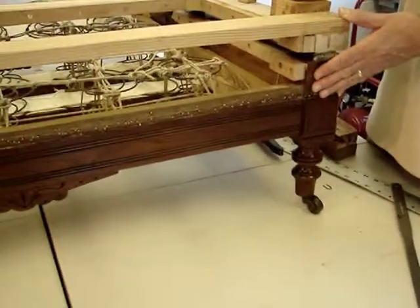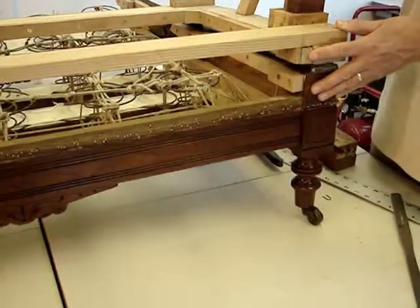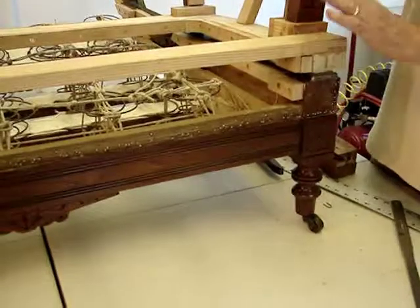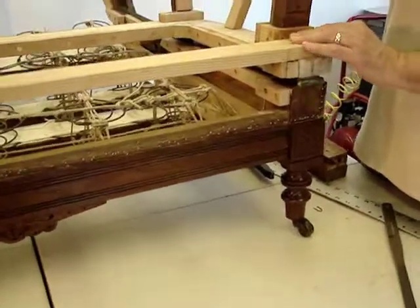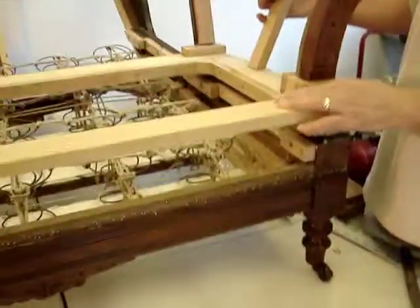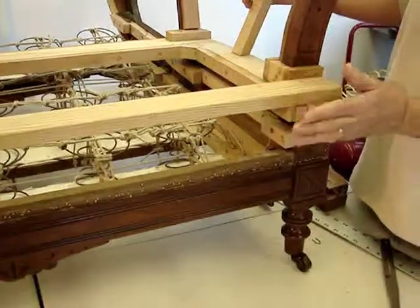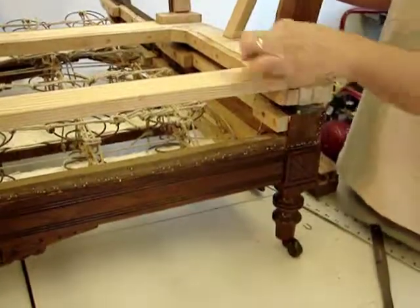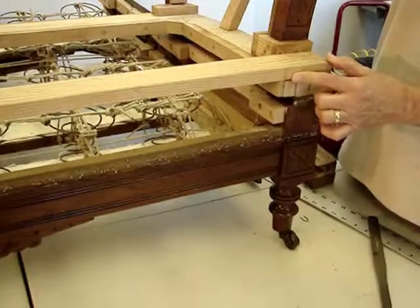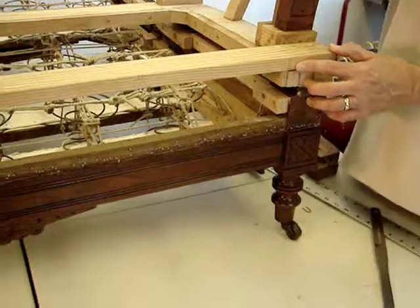I'm trying to figure this out — let's see if I can improve upon it while maintaining the spirit of aesthetics. There's also this front spring rail, which is very unusual. Typically, the front rail would be flush with the side rails, and the center of gravity would be determined by the pitch of the seat, which is not so here.